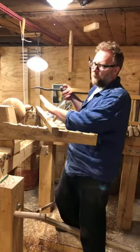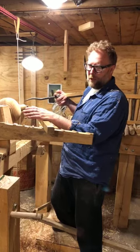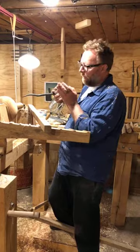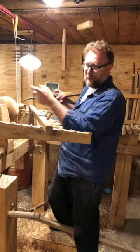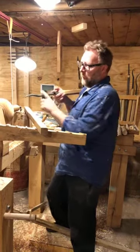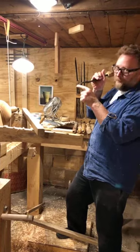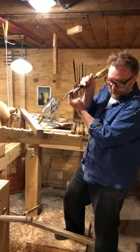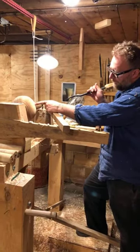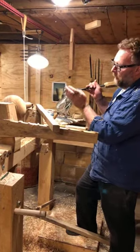So I'm always on the surface cutting along, and every place I touch the hook, I need to adjust the cutting angle — around 10 degrees, and just below the surface that's spinning in front of the blade. So if you have a big bulge, you're going to have to be way out here to catch that bulge first. And then there's the 10 degrees and the twist that's cutting just below the surface — that ledge is what I talk about when discussing the angle.